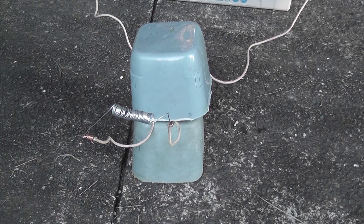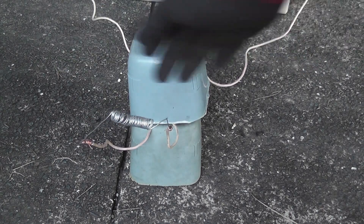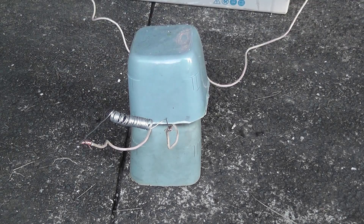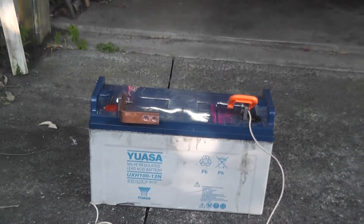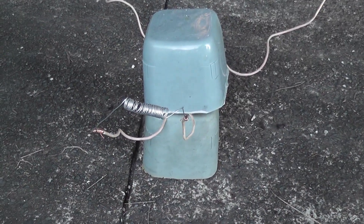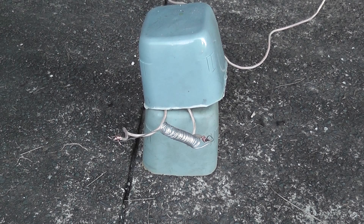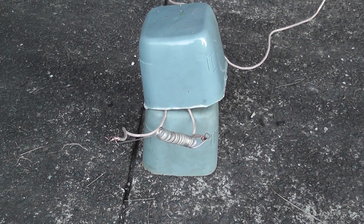Our folks are doing a quick preparation test for new heating elements to see how it performs. It's just a simple wire wrap — 20 to 22 turns with wire wrap on the inside. We'll see how it's going to go. Accumulator up there and let's quickly pop it and see what happens — how quick it goes, how slow it goes. 12 volts. May have to have done 24 or make the elements shorter.